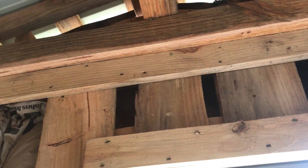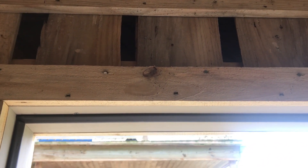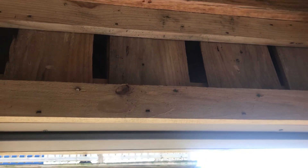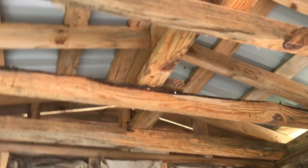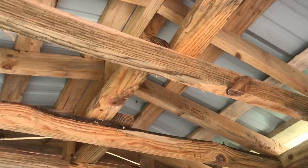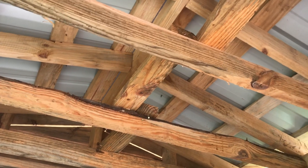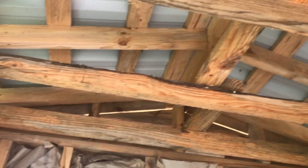I'm going to cut some little scraps of insulation and stuff them into these pockets up here just enough to close up the gap - same thing on the other side. I had nailed those spacers up there so that when I put my trim up - should have insulated behind them but didn't have it at the time. I might take the saw and cut out a little hand hole, but I'll just cram some in to fill those little voids. I also put some cross-bracing pieces up there - I'll call them a rat run - just so there's not too much flex in the joists side to side. Figured it didn't hurt, just cut a couple little scraps of blocking and nailed them on top.